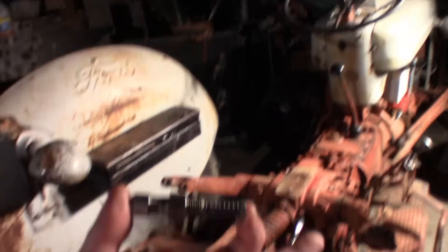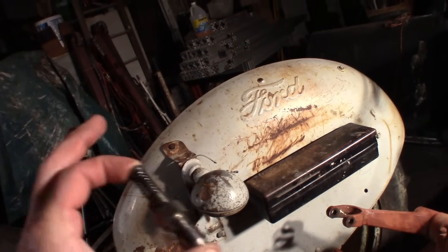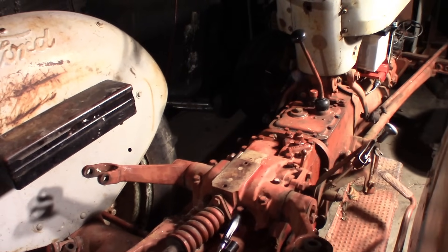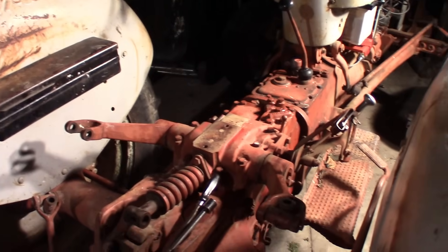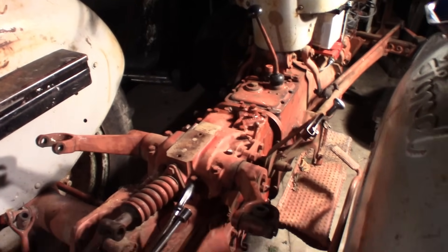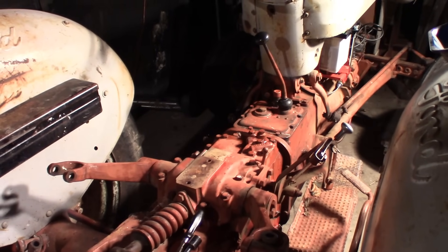One other thing I did change while I was in there — this is the relief valve that goes in the side of the pump, right next to that control rod that goes in and out that I took off. I bought one of those for the 2N and it's supposed to be the same part. The 2N goes in the hydraulic pump in the belly; on this Golden Jubilee it goes in the hydraulic cylinder. So I changed the relief valve. Pretty much the two possible leaks are the piston and the relief valve. So hopefully this will take care of the hydraulic issue and we'll let you know how it goes.